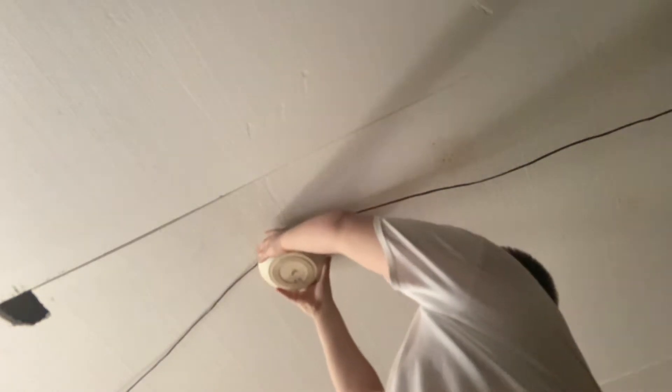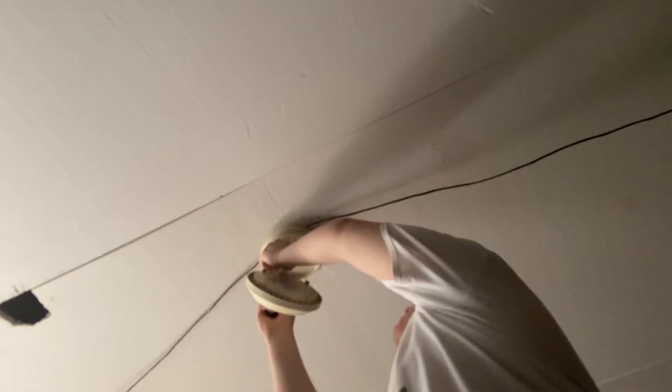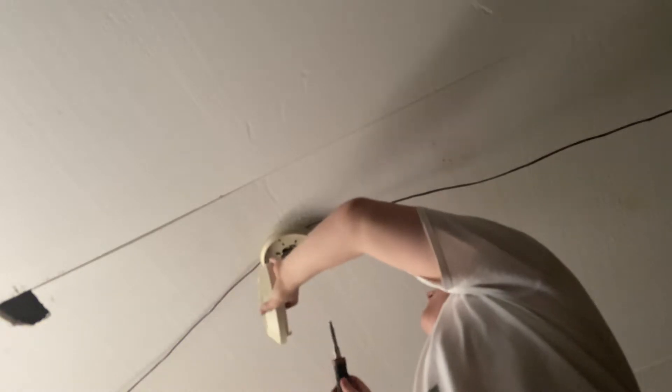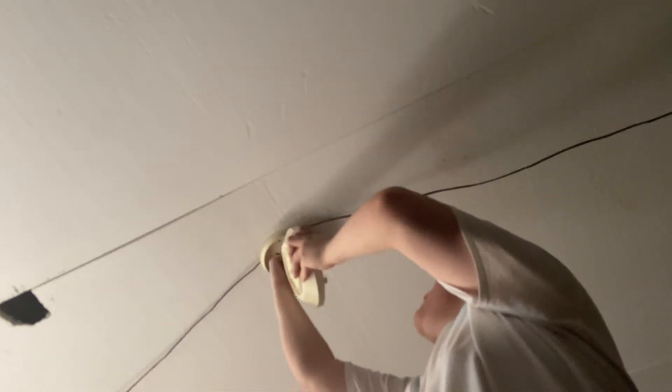After turning off AC power, I'm going to twist off the alarm. This doesn't even have interconnect — not like it's being used, but still. Interconnect is a necessary feature in new construction. I acquired this alarm off of eBay. But if you just follow these steps — on very old models, you had to completely unscrew the mounting hardware. And there we go.